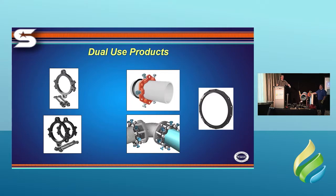Now, on this one, if you're using it on steel pipe, unlike the black one on ductile iron pipe, you would have to remove the washer so it could get down and bite in enough. We've removed a few. We'll show you how to remove that washer after, but there are washers, and that's just because it can be used on the plastic pipe as well.